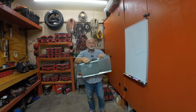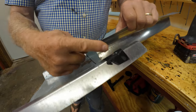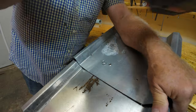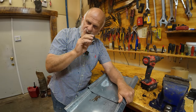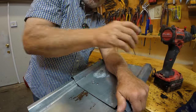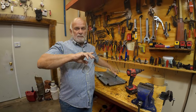Why is your metal roof leaking? This is butyl tape. They put the panels together like that with a screw — that is the initial installation. But after a few years you need to re-torque these screws because they slightly loosen up. Watch this video. It's the most important video for any metal roof owner.